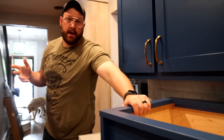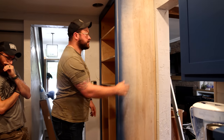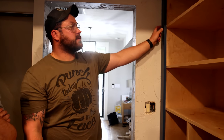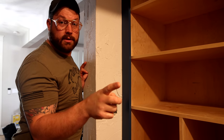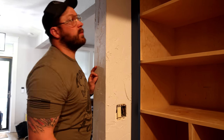Backsplash is done, which means we just got to get a couple cabinets. We made a few adjustments — we had a couple of hiccups in our measuring, so Jordan rebuilt some cabinets that just came back from finish. This is our pantry. We left a long ear over here, which is going to give us an opportunity to scribe this cabinet into this janky wall and give it a nice tight fit. Sam's going to handle that because he is a wizard of scribing. We've got one shot at it.